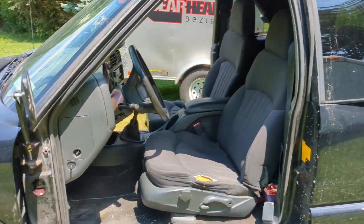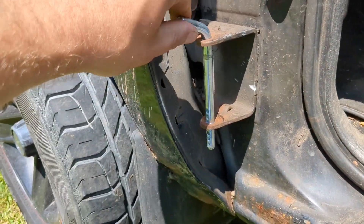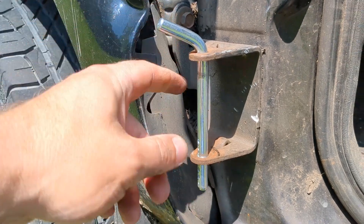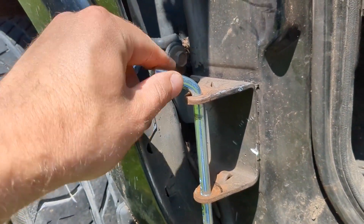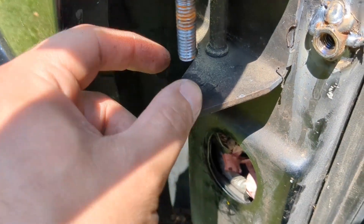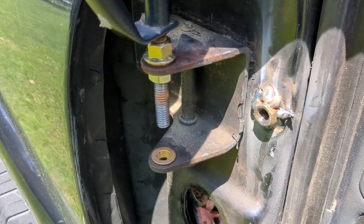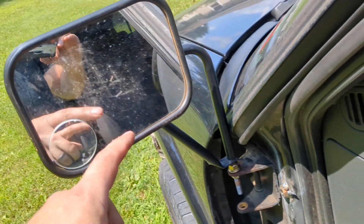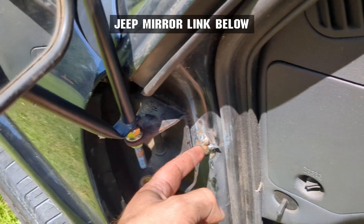I did it with hitch pins just like before. Anything smaller than 3/8" you can just drill out, and this one here is slightly bigger but it's good enough. Stuff that's bigger than 3/8" you drill out to half inch and use these little bushings — I've got a McMaster-Carr part number in there.